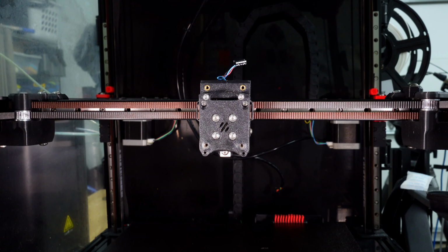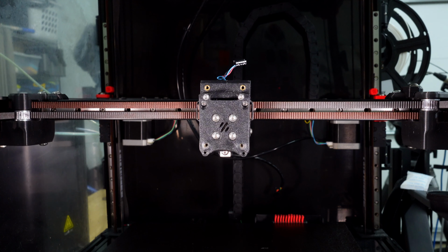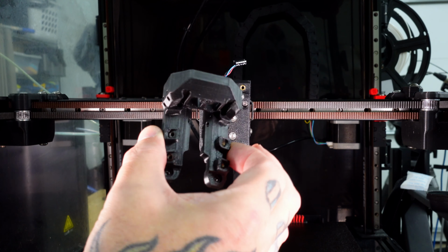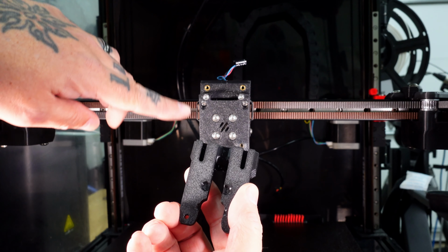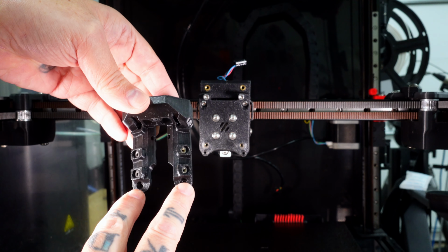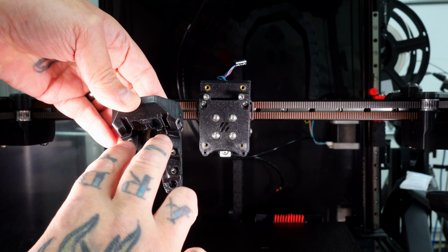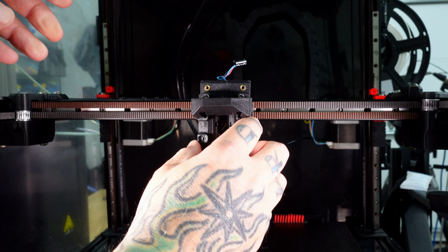So that's the major assemblies of the Reaper toolhead. Let's get over to the printer and get this thing reinstalled. All right, let's get this installed. So you can see here, I have the TAP mount front and center, and I'm going to take the carriage and get that installed. So that's going to slide up these slots on these screws. There will be screws that will go through the bottom here, and then I will tighten these screws to clamp through those holes. Put that up.